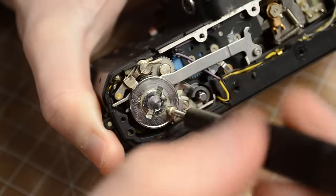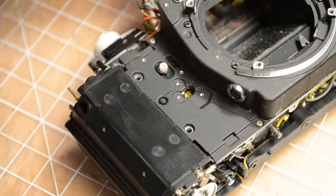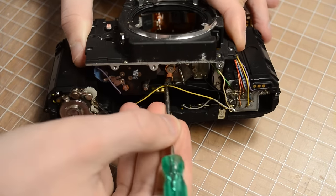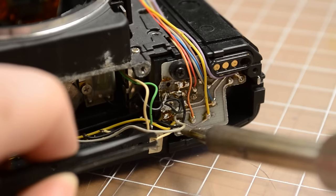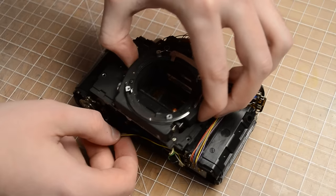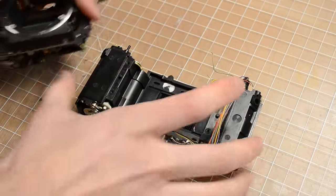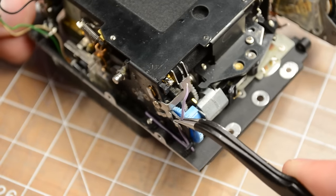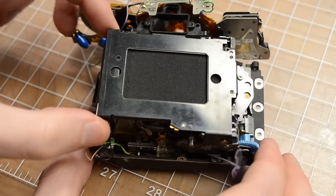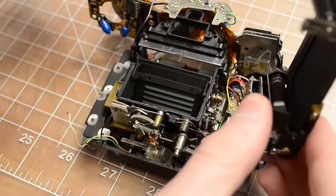The last thing I have to do is remove the metal arm that charges the mirror when the film is advanced. This will allow us to separate the mirror box from the back of the camera. I have to be careful to do this gently because there are a lot of wires tucked in precariously in various areas, and also a number of wires that I forgot to desolder. You basically have to desolder every single wire at one point or another, so it can get a little bit tedious and you're basically completely screwed if you don't take enough reference photos as you go. With the mirror box out of the camera, we can separate the shutter. You can see the two holes on either side of the film gate, and if everything's tuned properly, you'll be able to see the edge of the curtain on either side depending on whether or not the shutter is primed.